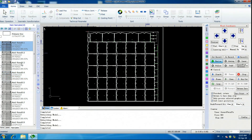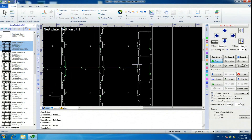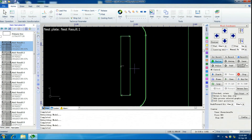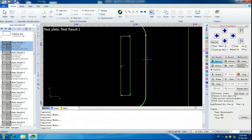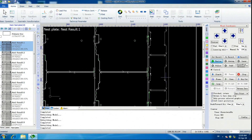Let's go ahead and load up the first sheet and we'll start cutting. Just a little mention: if you do really small parts — geometry like this where the square is only just over a millimeter wide, about 50 thousandths of an inch — when it cuts around, it's going to blow out and sometimes hits the edge of the nozzle, which causes a capacitance error. Just something to be aware of — your machine's not broken, it's just parts like this really mess it up.